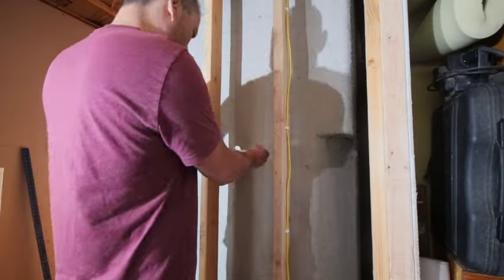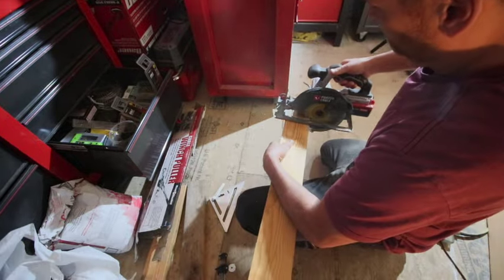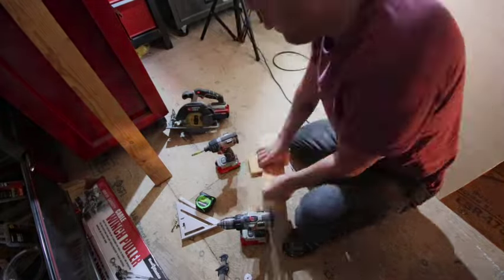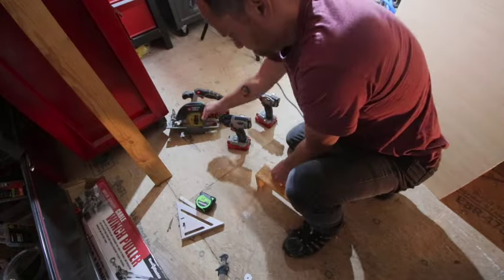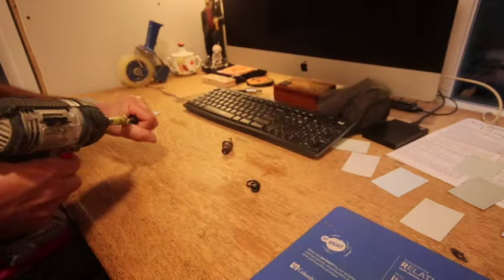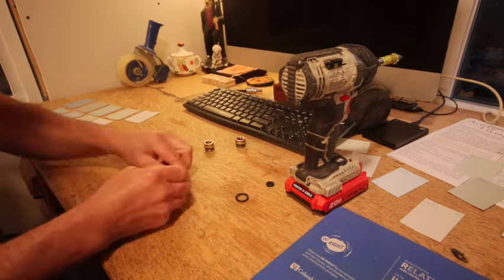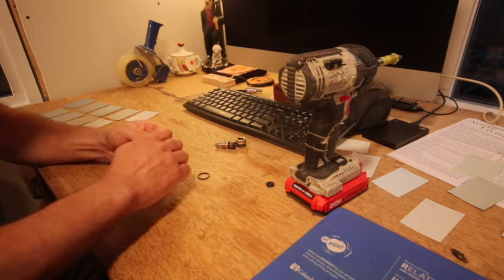Just one more hole in the middle at the top for the shower head. Then we went around the back side and made a bracket so I can tie the valve to it — it's a little bit sunk in on the other side. We made a little jig and hopefully it'll be strong enough to hold the shower valve. I don't like the single-valve ones most people have these days where you just turn the handle past cold over to hot. I like the old-style two-valve so you can control your hot and cold and the flow separately, so I'm just reusing the old one.